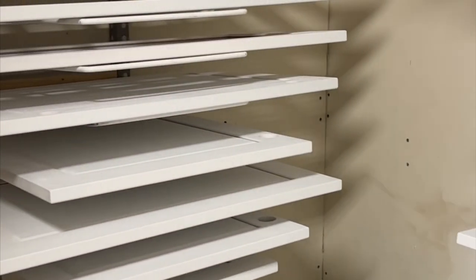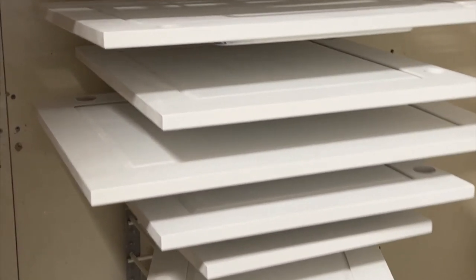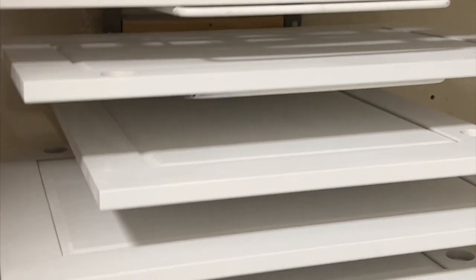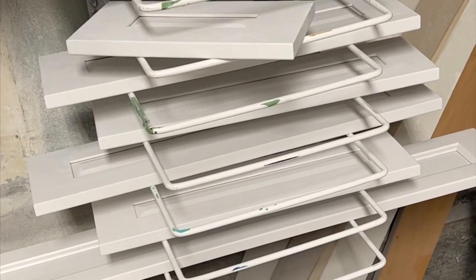Here's how I calculate how much top coat I'm gonna need on my doors. I'm gonna do Benjamin Moore 688 top coat White Dove. I go along and count my doors, figuring two ounces per door. Big doors with double panels I count as two separate doors, and smaller drawer fronts I count as a half door, so two of those together count as one door.